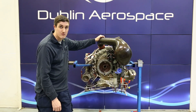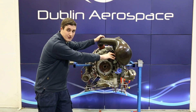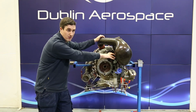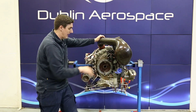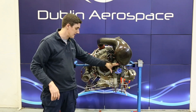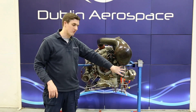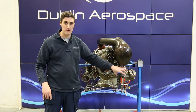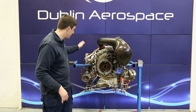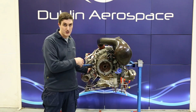It's powerful enough to light a small town, really. We have a starting motor here because the APU is electrically started using two 28-volt nickel cadmium batteries on the aircraft. We also have a lube module — an oil pump — with an oil pressure and scavenge pump built into one. Normally, a fuel control unit is also mounted here, which manages the fueling for the APU and provides fuel pressure to both the surge control valve and the inlet guide vane actuator — both of which are fuel-actuated and both manage air.